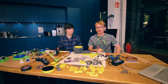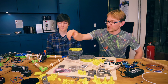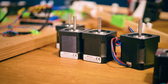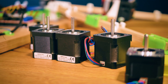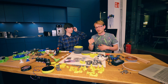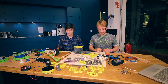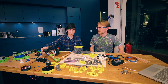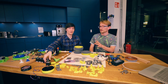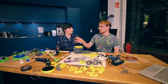Links to recommended motors will be on the project page. We are using the motor from Prusa, which Trinamic supplied, plus some of Trinamic's own drivers. These aren't perfect for what we're doing, but they work. For the A, B, C, and D motion axes, the motors themselves aren't that crucial, but you want beefy motors for A, B, C, and D so that you can run them cool — a lot of holding torque — and you don't need the high speeds you do with the extruder.